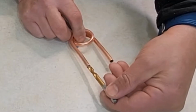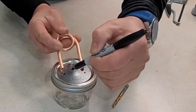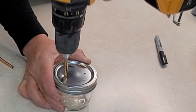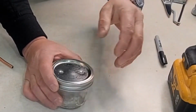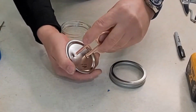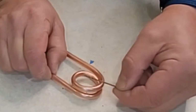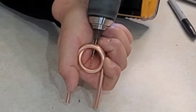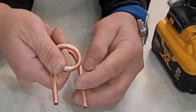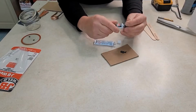Now you have to make the two perforations on the can lid. The important thing is that you cut just about the diameter of the pipe. Don't go too big, although you're going to put a little bit of that JB Weld. It's better to be as accurate as possible, so just find a bit that will do that work for you. Now that you know that it's going all the way in, we need to make one single perforation on the top of that loop. That's the only thing. Be careful. I'm using a 16th of an inch drill bit. I tried an eighth of an inch in the other one just to experiment, but an eighth of an inch is only as much as you need to perforate.